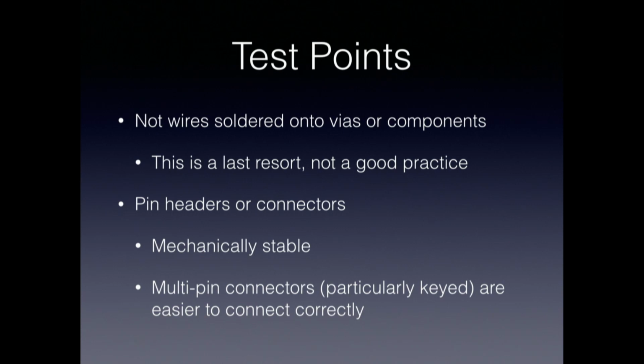And the disadvantage with a bunch of individual connections that you have to connect in a particular order is that there's a chance that you'll do it wrong the next time you need to do it, and you'll waste a lot of time chasing problems that might not be there. And there's also just a cognitive drag on having to do that. So if you need to reuse a piece of test equipment and you disconnect it from your project, and then you come back and you have to reconnect seven test probes in the right order or in the right positions, you may just not feel like doing it because it's a pain in the neck, and then spend time less efficiently debugging your board. So reducing mental drag and reducing the friction to doing things right is an important part of this as well.